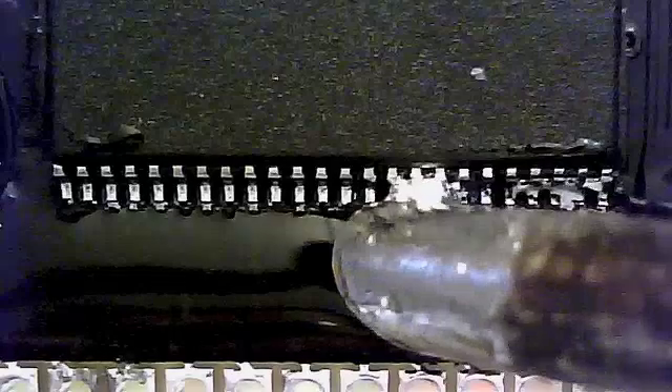I'm really having some trouble getting this to solder. Again, it's because I used too much solder. I was hoping to fix these bridges with just flux, but sometimes you just have to go back to the solder wick. A lot of times after using the wick, I like to add a little bit of extra solder to make sure the pins got enough solder. On this chip, it seems like maybe the flux just wasn't activating properly. Usually I can fix something like this by just adding more flux.